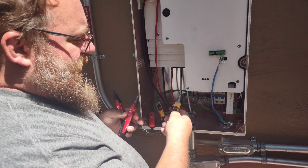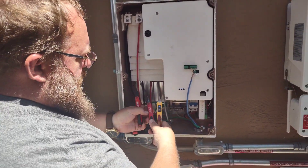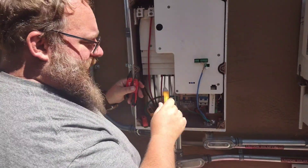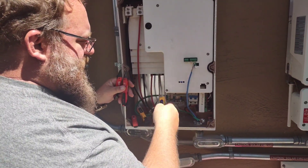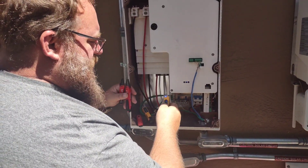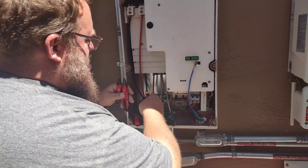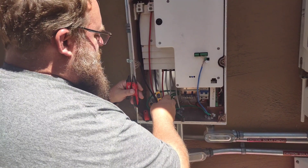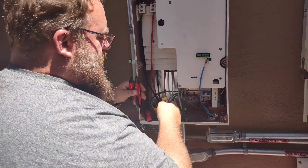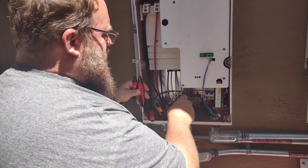The other thing I don't like about this one is that you have to manually select the voltage range. This is set to dual voltage, meaning it goes from 12 volts to 1,000, or 70 volts to 1,000. The Milwaukee version goes down to 10 volts, which I think is a little better. Remember, this is only AC — it will not work on DC. Only AC voltage. It works on capacitive electricity. Now I've got it set to the lowest setting, and you can see it's showing low voltage somewhere in here, and as we get up close, it does go off and switches over automatically.